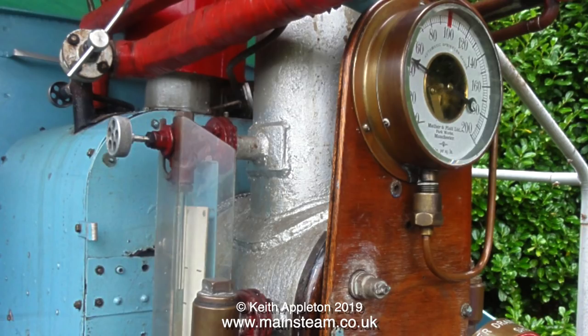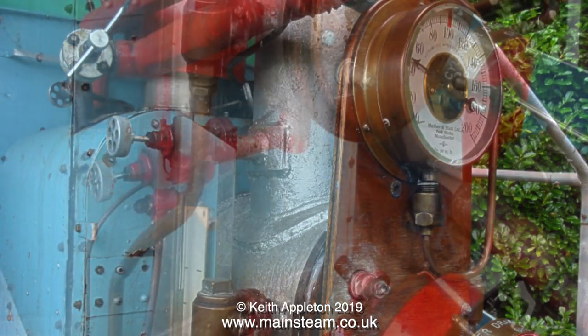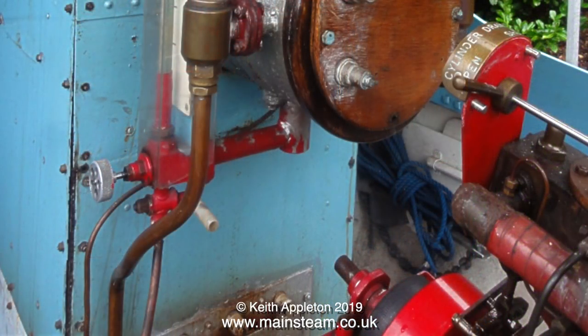Here's a shot of the pressure gauge and you can see the red line is at 100 pounds per square inch. Quite a few viewers ask me what is the horsepower of these type of engines. For a twin Stuart 5A, I read in a Stuart catalog that the specification for a standard single 5A running at 80 pounds per square inch is one and a half horsepower, so I guess this engine is going to be three horsepower at 80 PSI and maybe a bit more because it's running at 100 pounds per square inch.